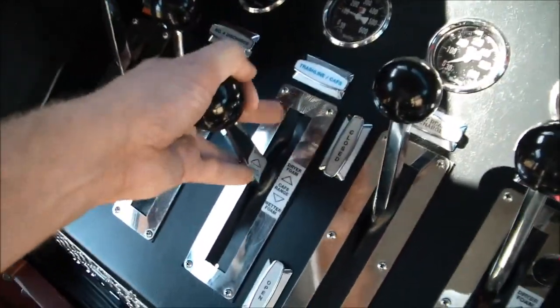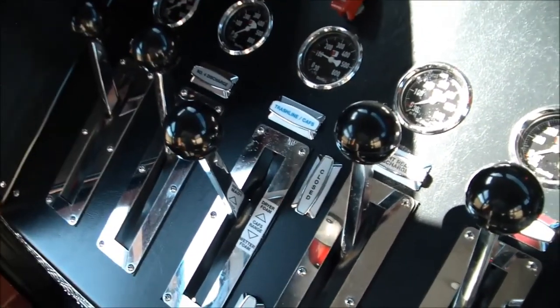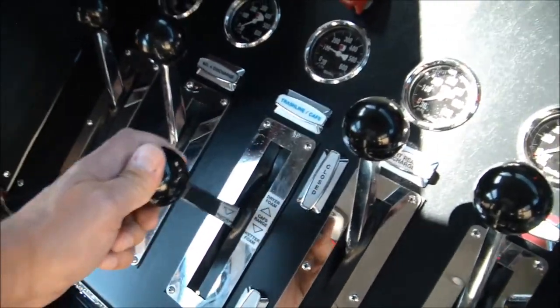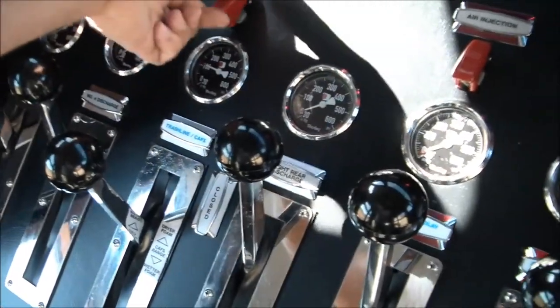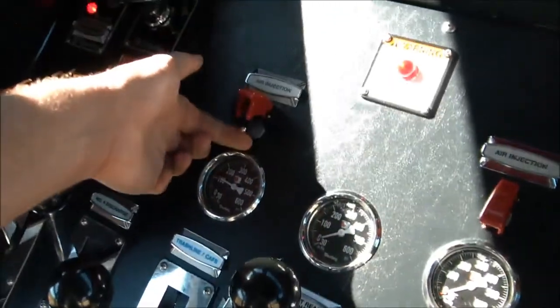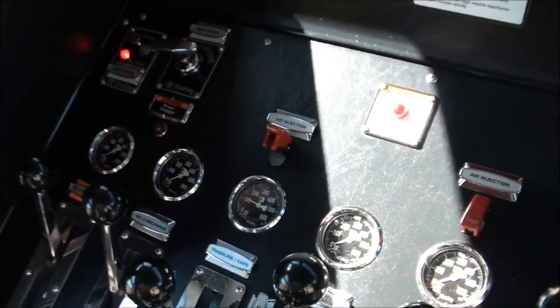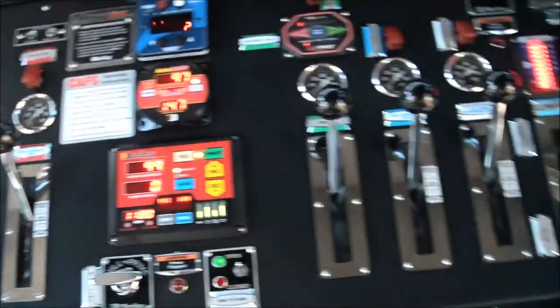We started flowing some water and foam solution into our trash line. We never open the valve wide open when you're making CAFS. You only need to open it up, fill the hose line with some water and foam solution, but before the line is completely full, you flip up your toggle switch cover and turn on the compressed air. And now we'll be making compressed air foam out of that discharge. So now we'll go out and open up the nozzle.